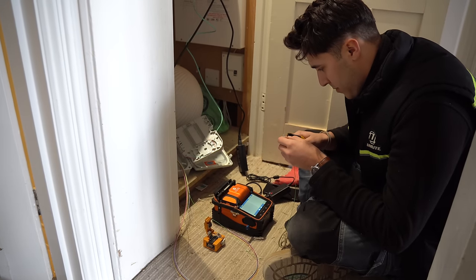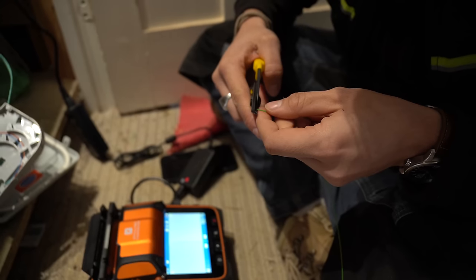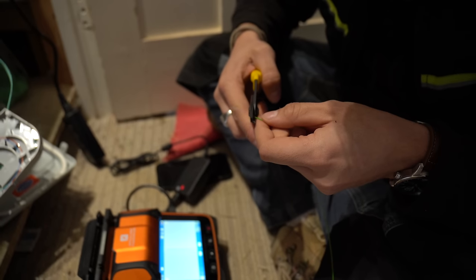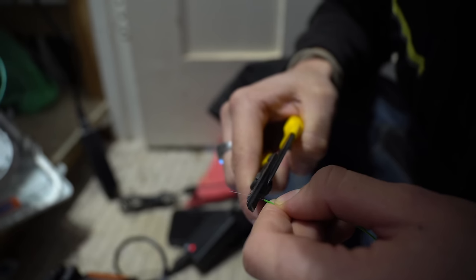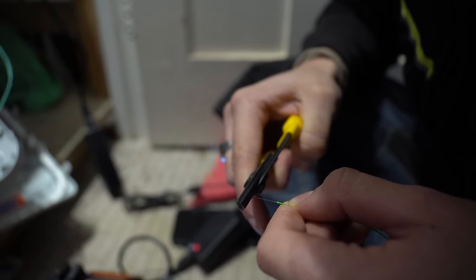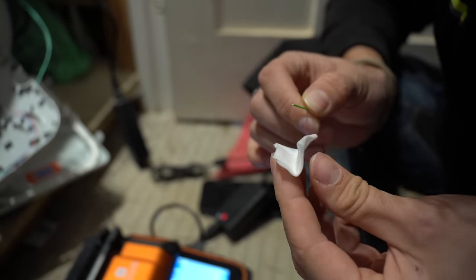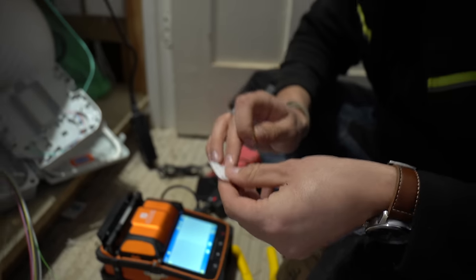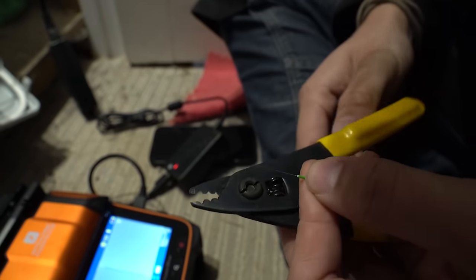Now I'm going to try doing this one myself. First get that outer layer off, then clean off that polymer acrylate layer at 45 degrees. I snapped it — okay, it is fiddly. You've just got to scratch the polymer off without snapping the glass. Then an alcohol wipe — polish until it squeaks. I snapped it again.